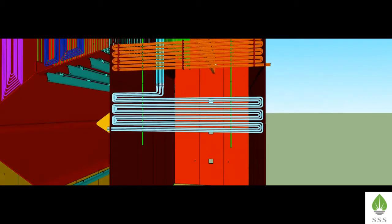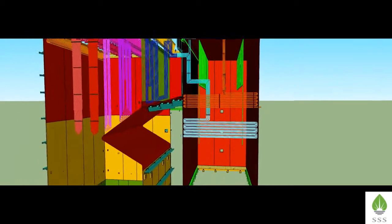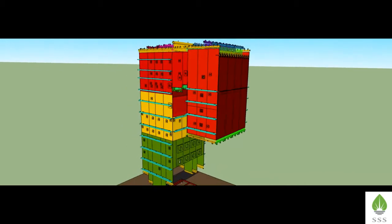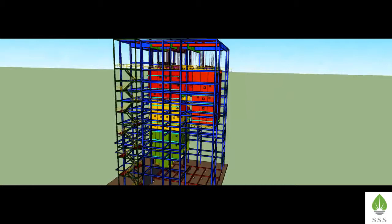So the coil cannot be routed if the cage rear panel was erected previously. Weld the cage rear bottom panel with the tubes of the cage rear top panel. Now we can see the complete boiler with the structure and right side wall panels.